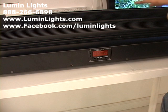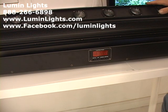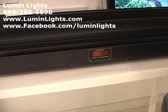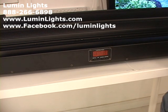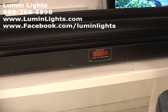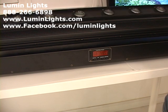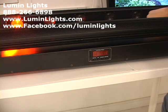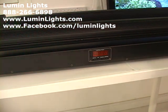I've set up a second bar with the power plug connected and a DMX cable connecting the two units. Either unit can communicate and control the other. I'm turning on the back unit, letting it initialize, then setting it to built-in program five — going to AU, up to five, and hitting Enter. You can see the lights in the background flashing red.